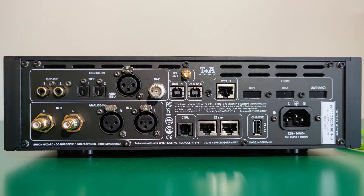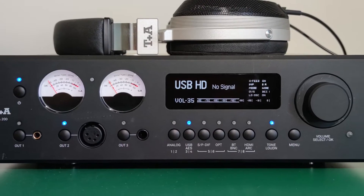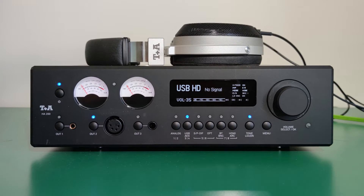All the DSP of PCM data is carried out by a double differential quadruple converter with a conversion rate up to 768 kHz. The T&A True 1-bit DSD converter converts DSD data and processes it in a native bit-stream form, meaning DSD data up to DSD 1024 arrives from the USB input of the digital connecting board and can therefore reproduce to the really highest quality. I'll put some of the specifications in the description box below, and if you have any further questions, ask in the comments.